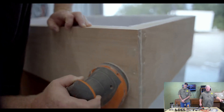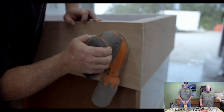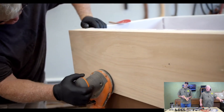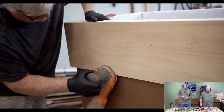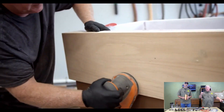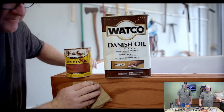When I put the facial boards on, I did use trim screws on the end. I've had customers who just used glue and they ended up separating. I want to make absolutely sure those things are going to stay for good. I just sand everything really well and when I do the finish it blends in pretty well. You'll notice I have three holes in the middle — I wasn't terribly concerned about filling those in because the drip tray is going to completely cover them. Notice how high they are though — that's extremely important. You do not want to drill into your freezer because you've got coolant lines all over the place and you don't know where they are, so you likely will puncture a coolant line. Be careful to only screw the wood into the wood.